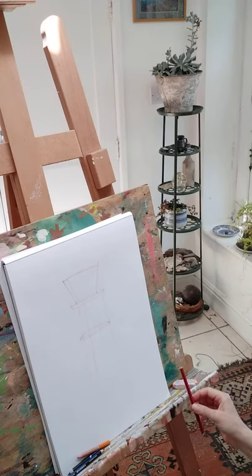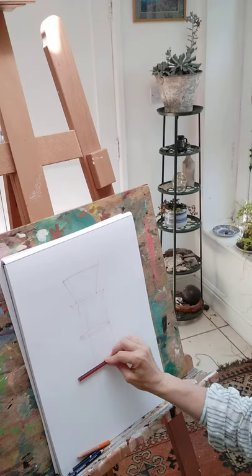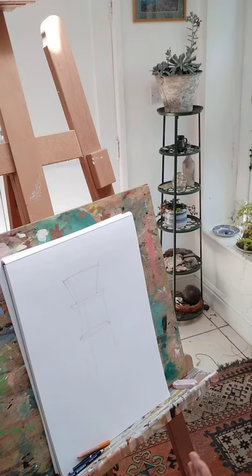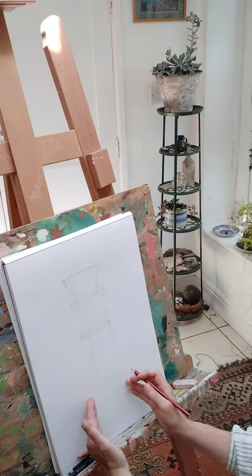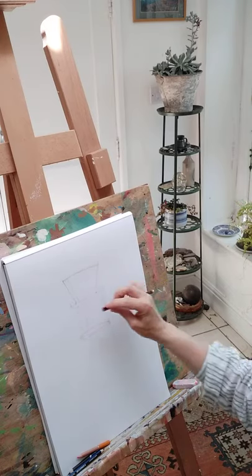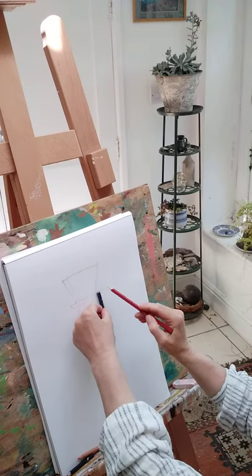I started with the shelf and then plotted the angle of the uprights, because they were very useful in plotting my shelves. It looks like a straightforward object but it's actually quite complex — the legs mean the shelves aren't quite central. I checked the angle, brought it back, measured the distance from the center of one leg to the center of the other, did the same for the others, double-checked from each end, and then precisely measured the width going either side of the central point.